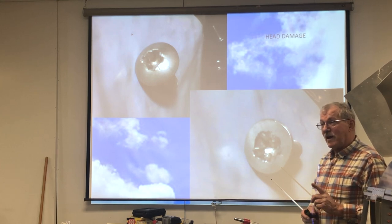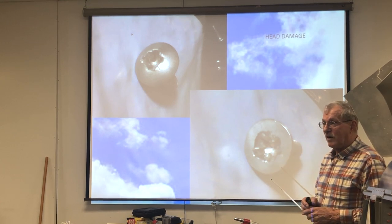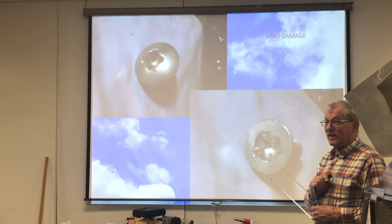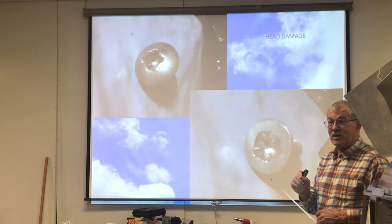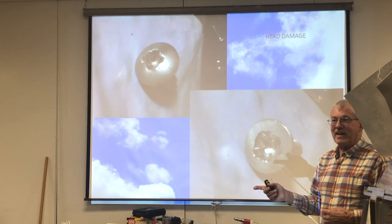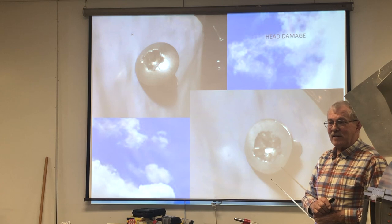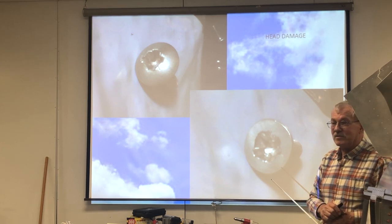As an example, I brought some show-and-tell stuff down from the Taylorcraft that I'm restoring. It's a 1939 Taylorcraft. One of the things over there is a brake and wheel assembly. I took that brake assembly off an airplane that I rebuilt back in the early 70s. I had put the brake in with countersunk screws, and I put grease on each one of the screws because I had no idea how long it was going to take before the screws would ever come out. I happened to get the remains of my old fuselage that had those brake assemblies on it, and by golly, I took those screws out just the same way I put them in, and there was still grease left on them after 50 years, because I put those wheels together in 1973. So it does pay off.